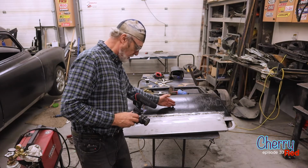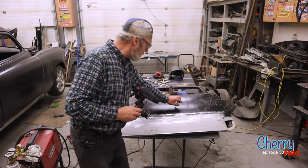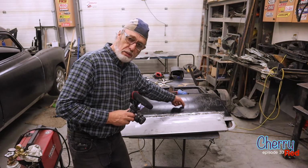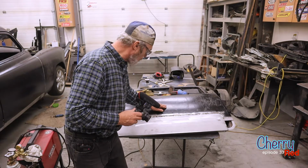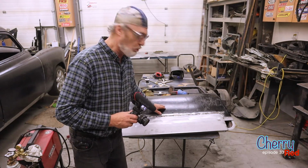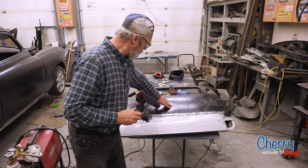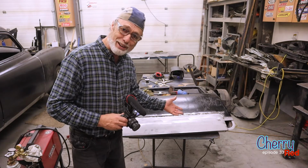When the window rolls down, it stops about here. And that stop has some felt or something in between it and the door. It's a flat piece, right? And it's got something in there that actually holds us out, and that's all gone out of there. So I don't know if it was some kind of rubber or whatever. So we'll replace that, and that'll actually stop that, which is different because most panels you don't have that, right?